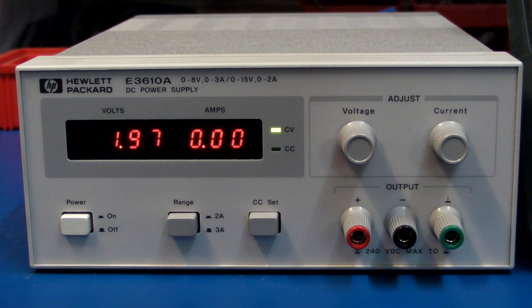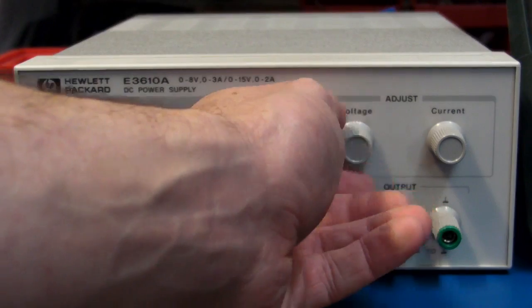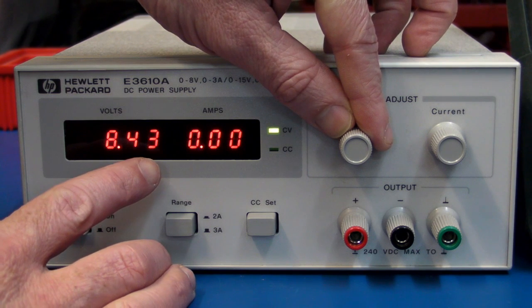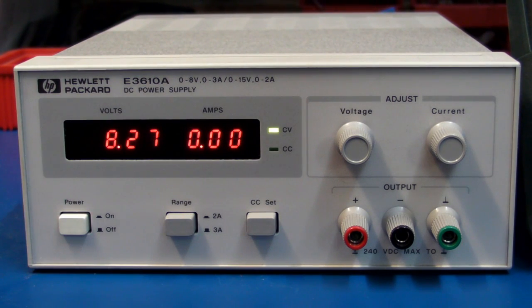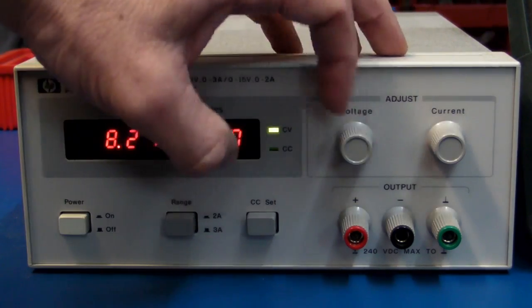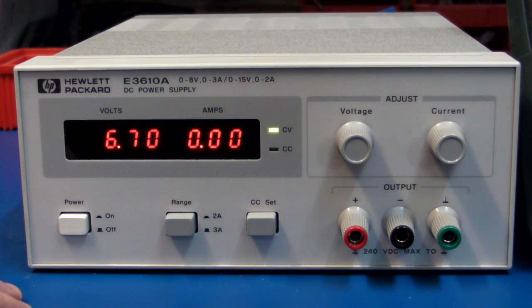One of the most important things people often miss on a good lab bench supply is it must have a nice multi-turn pot. These Hewlett Packard ones have a nice 10-turn pot. I can just tweak that down to 10 millivolts resolution, no problems at all. If you've got one of those cheap bench power supplies with just coarse and fine voltage adjustment — only single-turn pots — they're no good, you can't get the resolution you need. This has a 10-turn pot for the current set as well — beautiful. Those pots are quite expensive, but it's well worth it.